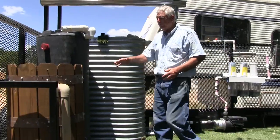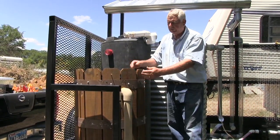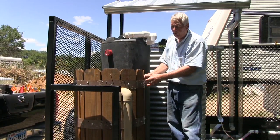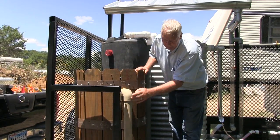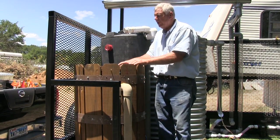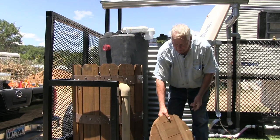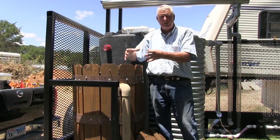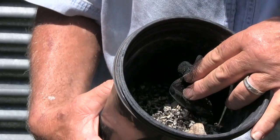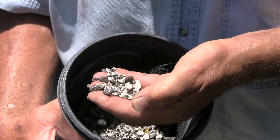At the front I start off with a rain barrel — this is a blue barrel that I've put a covering over. These are just wood slats with metal strapping around it to hold them in place. This is going to be the overflow, then we want it to go out to the rain garden. I also put a little cover over the top, and inside I drilled a six-inch hole with window screening, then added rocks to hold it in place to help filter the water and keep larger debris out.